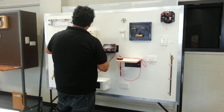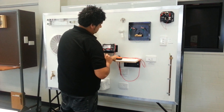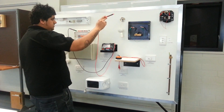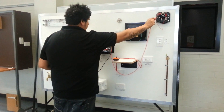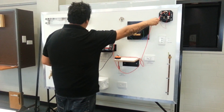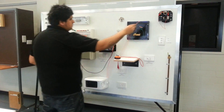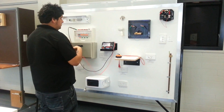Now, insulation resistance. We're going to do the insulation resistance on the 500 volt scale - that's twice the amount of voltage. I'm going to test my bridge where I've bridged it out, and I'm getting infinity. Double check the meter to make sure it's working, which it is. So I'm getting infinity, which is really good.